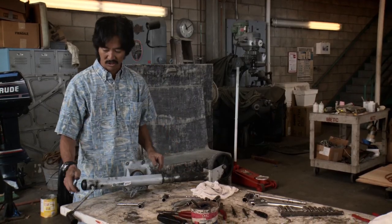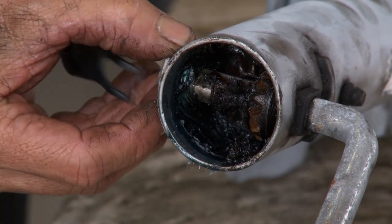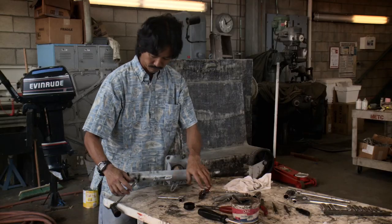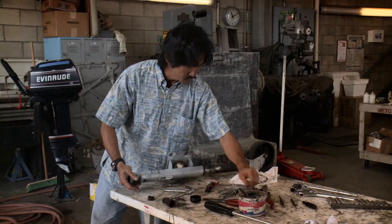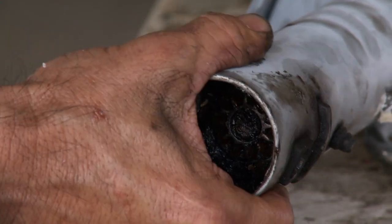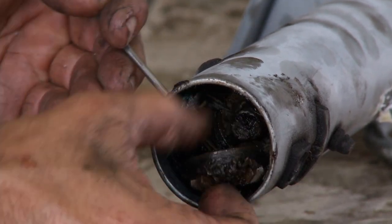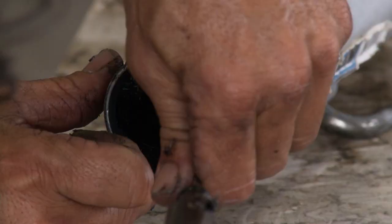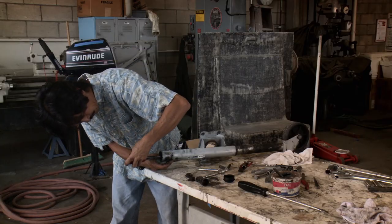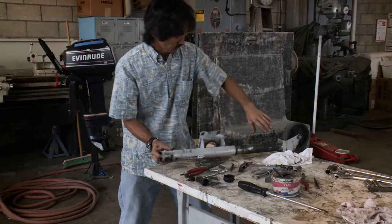As you can see, there's some rust on it. This has a little circlip up here on the handle that needs to come off, and a washer. This handle should back straight out — that should free up this gear. These two gears are actually what spins this screw jack. And then I need to get this pin out. This pin is actually what holds it all from falling out the bottom.